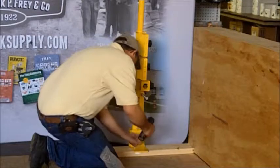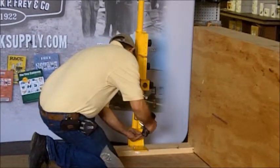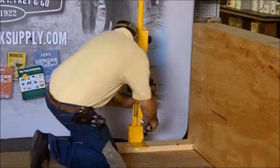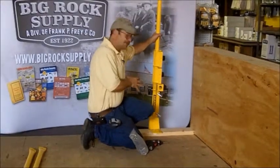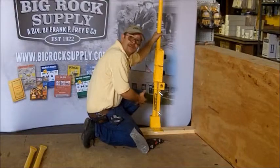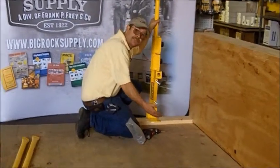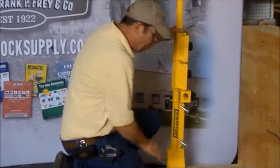Alternate your patterns to keep from splitting wood grains. On this particular one I have set five screws in it, screwed down into your two by six blocking at the low edge detail. There's ample room here to allow for insulation when they come back, and then as they're doing the roofing it will all fit right in place.